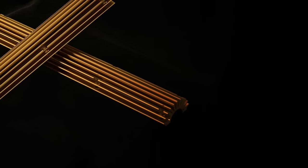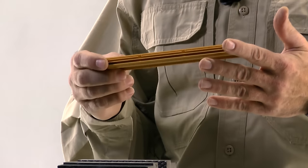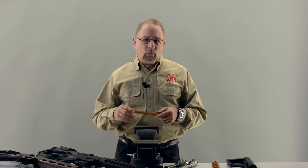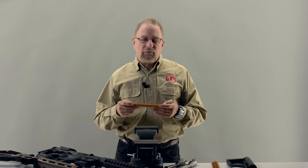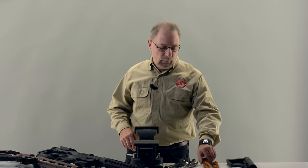Finally, in the cosmetic department, I've got a couple of new things. First off, we've added another color to the thermal dissipator line, and that would be gold — gold anodizing. The thermal dissipator adds about sevenfold the surface area on the barrel where the heat is actually developed, so it does a great job functionally of keeping the barrel from thermally loading, but it's also an outstanding cosmetic feature that you can see underneath our handguard tubes.